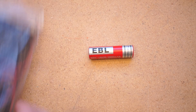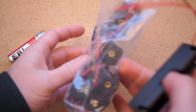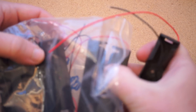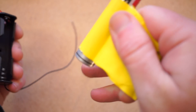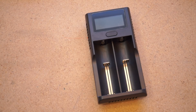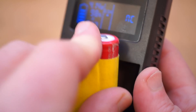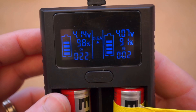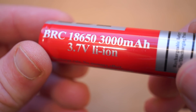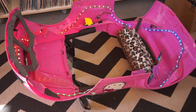Using a single 18650 has worked the best. I bought a 10-pack of these holders on Amazon for around $7, wired one up, and glued it in. With this, it runs for longer than I need, and a loop of gaffer tape around the battery makes it easy to pull out when I need to recharge. You do need to get a special charger — this one with a nice LCD cost me $16 on Amazon. It runs off USB. You can get cheaper ones without the screen. They're great for powering small project boards and LEDs, which are honestly the bread and butter of most maker projects.